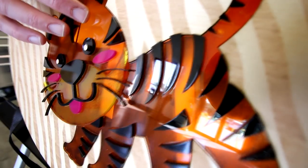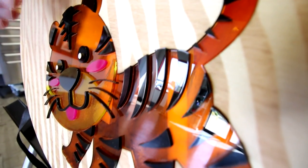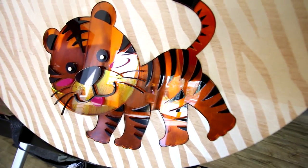Finally there's our positioning. As you can see we've kiss cut our tiger, meaning we've done a very quick light cut that just grazes the top of our acrylic in order that we know exactly where to place our pieces on top. You can do this with a CNC, but certainly not with a scroll saw.